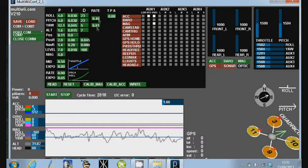Normally when you have the board from basic, it's 0 and 0 in rate. This rate is for roll and pitch, and 0 is kind of for newbies. If you're just learning, it's a great setting. 1.0 is the maximum, and that is super aggressive. I found 0.4 is kind of soft acrobatic. 0.7, 0.8 is kind of hard acrobatic. I've had to put my rudder up to 0.9 just to make sure it's snappy enough but doesn't overcorrect itself.